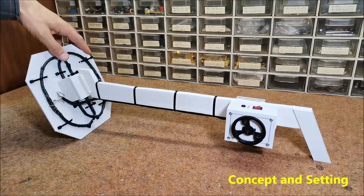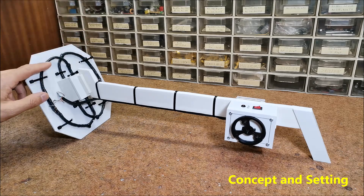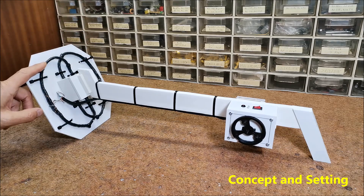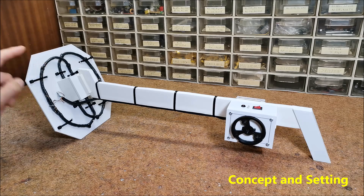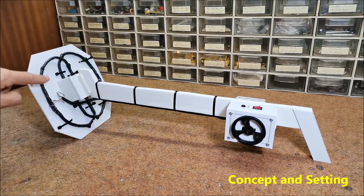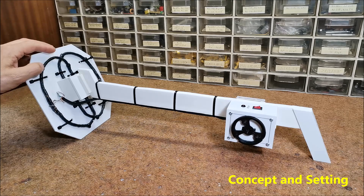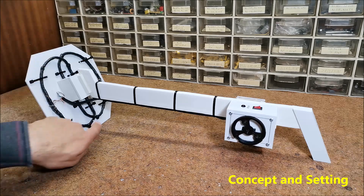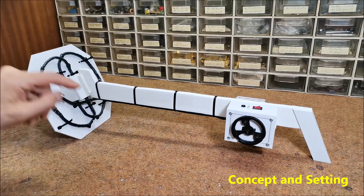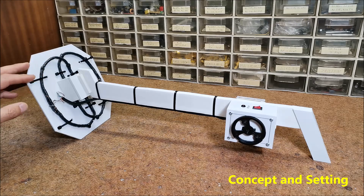The two coils should be identical. Each coil has a diameter of 12 cm and consists of 70 turns of 0.32 mm enameled copper wire. The coils are then folded in the shape of the letter D, wrapped with tape, screened using aluminum foil bound with tinned copper wire, taking care to leave a small gap so that the screen doesn't behave like a shorted turn, and then tie-wrapped onto a plastic plate.